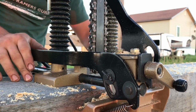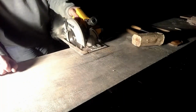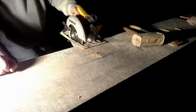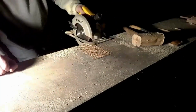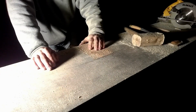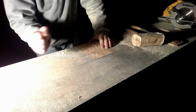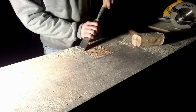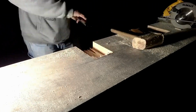So, moving along to the next tools. I say tools because I have 3 of them that I've used in this build, and that would be your circular saws. Now, I use the 7 1/4 inch regular standard circular saw. That's great for kerfing things out. It's actually really good for kerfing out your deep cuts first. It kind of helps your beam saw blades get through it a little nicer. So we use this one quite often.